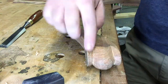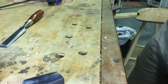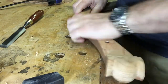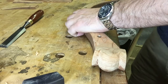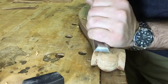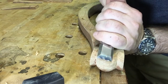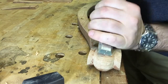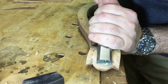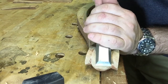It's not going to raise the grain as much because it's a cut surface as opposed to a sanded surface. I've done the top and you sort of want to turn it over and come from both sides with this. Using a wide chisel, it's just going to take little cuts like this until you go through the rasped finish, and you're not changing the direction or the shape of the surface — you're just removing the rasp marks.